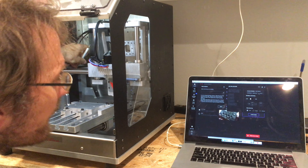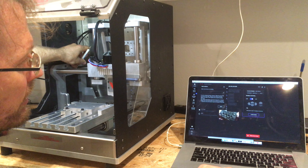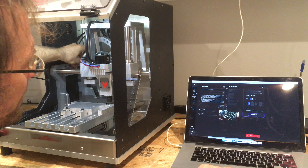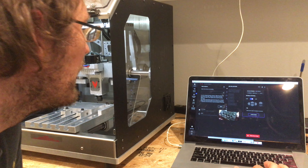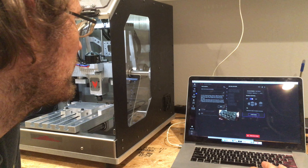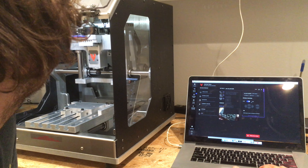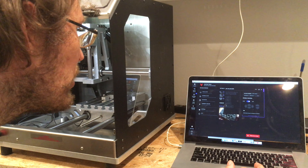I've got the limit switch held down and I'm in step mode — it seems like we completely ignore the limit switches. That means you'll never know if you crash. Am I going to crash the machine? I really just want to see if jogging works. I'll re-home just because we're there — god it's slow.